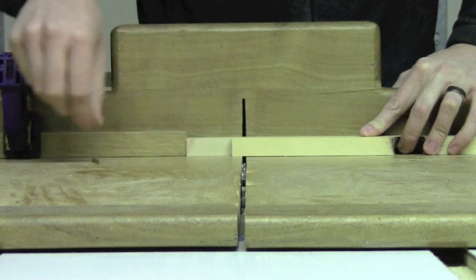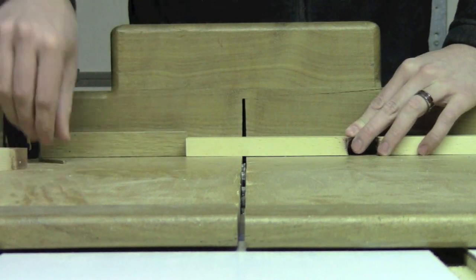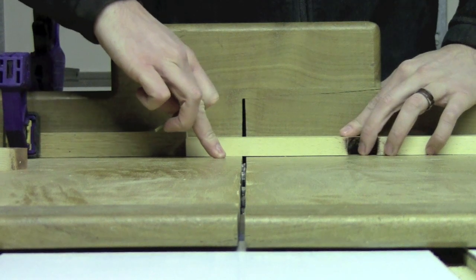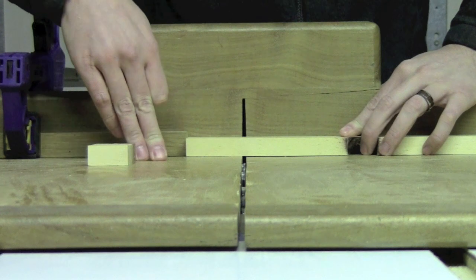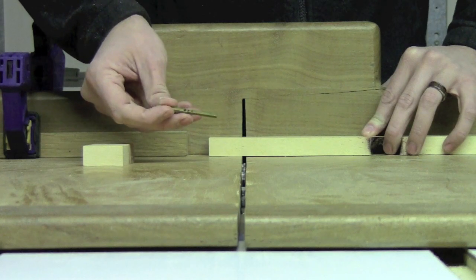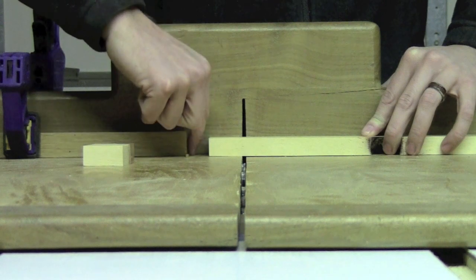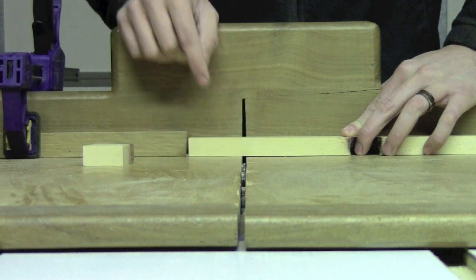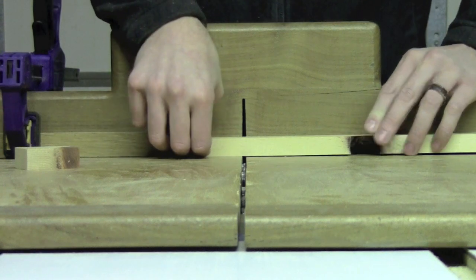We're going to make a relief cut, then remove the spacer and push it up against the stop block. What you need to take into consideration is that the first cut is on this side of the blade. In order to make it the exact width for the leg or rail, you need to be on the other side of the blade. So we're going to use an eighth-inch feeler gauge spacer - a brass spacer I used to adjust the height of the blade - and put it in place to act as another gauge. This will push that line over to this side of the blade and it will be a perfect fit. We're going to test it on a piece of scrap and see how we do.